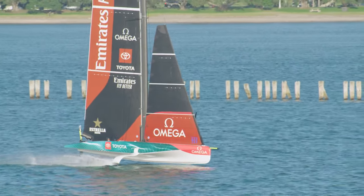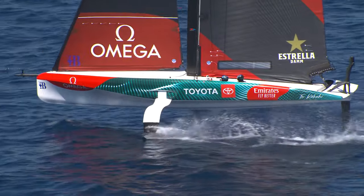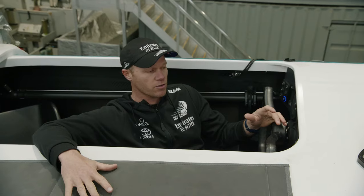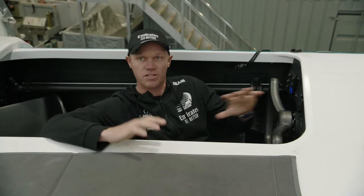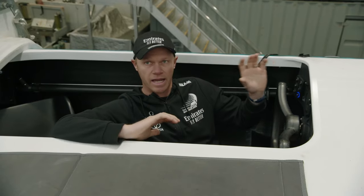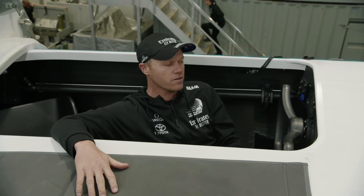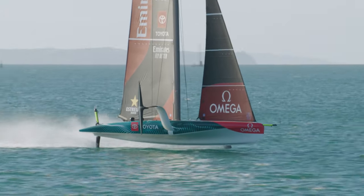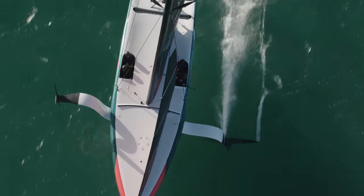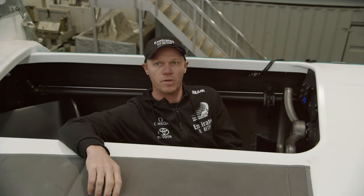In terms of buttons and switches, starting on the outboard side first: you've got a board up and a board down button, so you can effectively push those while driving. The trim plus and trim minus buttons are all to do with the autopilot system — you can set all the settings and the boat will sail itself in terms of its flight. In our test boat we have the ability to use the autopilot and manually, and I can guarantee you the one design boat is significantly easier to sail. But we still have to put inputs into the boat — we decide the sink target, how much ride height we have, the trim of the boat, and where we put the cams. It might sound like it sails itself because it's got an autopilot, but there's still a lot of human inputs that need to happen.